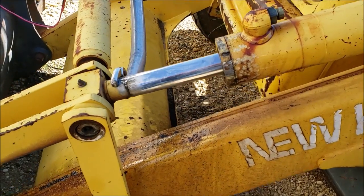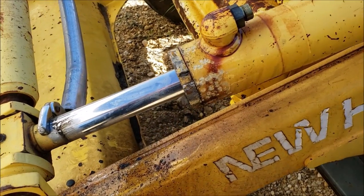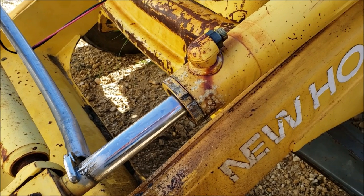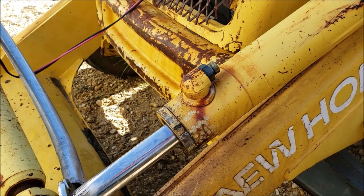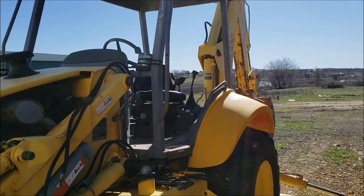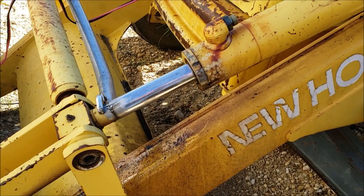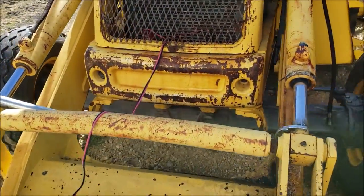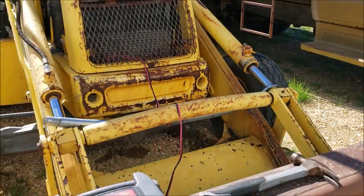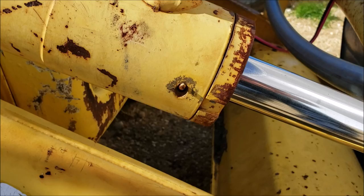Not only is this video about replacing the seals on one of these tilt cylinders, it's also about how to get a gland nut like this off when you just can't get that thing off. This one is not threaded. If you have one of these New Hollands — this is a New Holland LB75B 2001 model backhoe — these are not threaded. They're actually held in by a retaining wire. As you can see now, I finally got that wire starting to move. These retaining wires just hook on and you spin them until they wind all the way up in that little hole, and that's what holds the gland in.